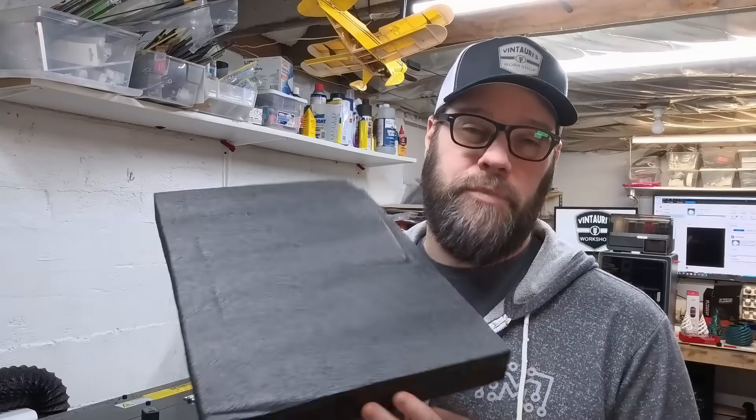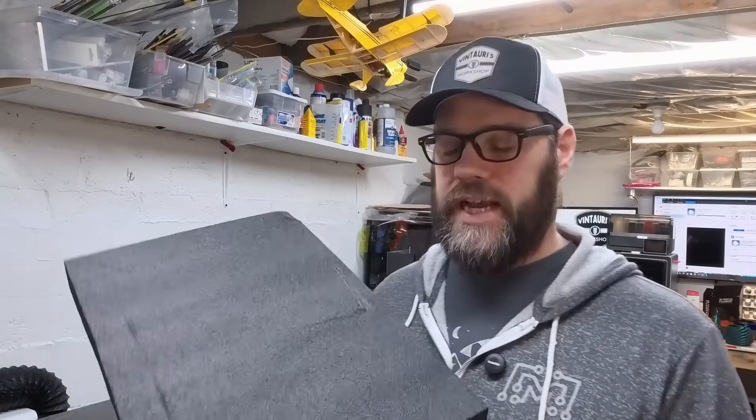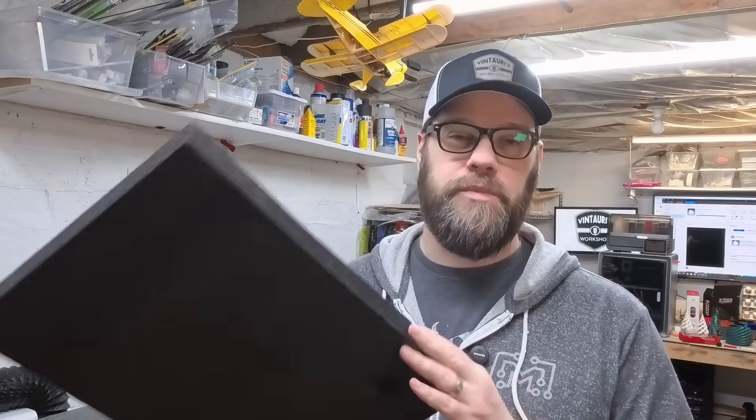One of the questions I've gotten from a lot of people is: can you cut some of this thicker foam? This is used in a lot of packing material with our machines and lasers. You can buy this in sheets here in the US — sometimes it's sold as Kaizen foam. What it is is polyethylene foam. It is safe to cut. The thing to be mindful of is that when they're layered like this, some adhesives could be PVC-based, so you do want to be careful and maybe do some tests to figure out what the adhesive is before cutting.